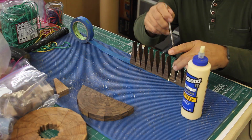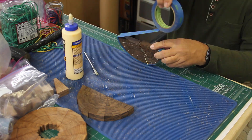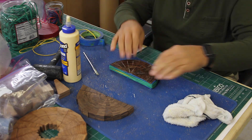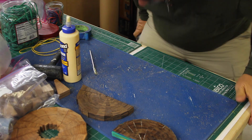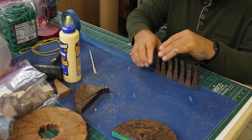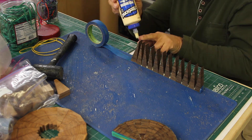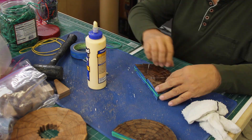To start building this bowl I'm working on the base first. All of my bases I try to use segmented pieces when I use some type of resin in the center. On those rings with an open section in the center I can glue them all up together at one time. On this base it comes closed in the center, so it's much easier to glue up half at a time — 12 segments, then 12 again. Once they're all glued up you can sand them smooth so they fit flush against each other and make a nice tight bond.